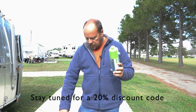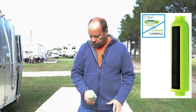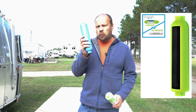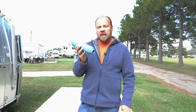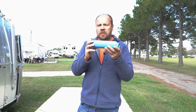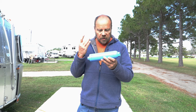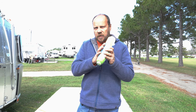The difference between this filter and this filter, besides being green, is the fact that this has solid carbon in it. This one will filter down to one micron, while these loose granular carbon filters operate at 20 microns. The other issue with granular carbon is that water develops a path through the filter — like ant farms where ants make little passages through sand — so the filter doesn't perform as well over time.